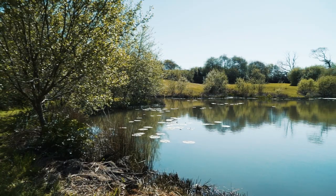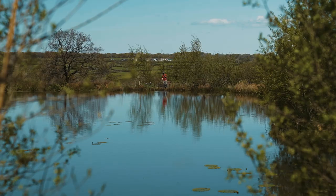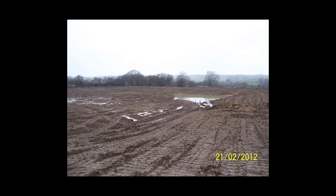My name is Steve Dorr and we're in my fishery Sanctuary Lakes in North Devon. My dad and I wanted a project because he had retired and we were looking for something to do together. We came across this six-acre piece of land — just a field and mud — but it had everything right to create a pond. It's very boggy, and if you dig down deep enough it has clay, so you automatically get a liner. There's plenty of water coming up through the ground, and a slight incline which lets you cut and fill to create a dam on one side, so you don't have to remove material from the site, which cuts down your costs.